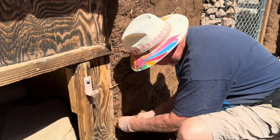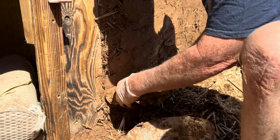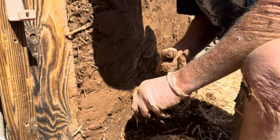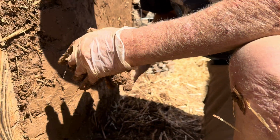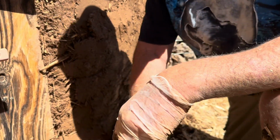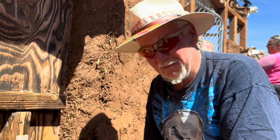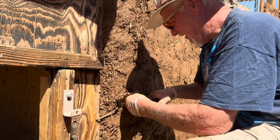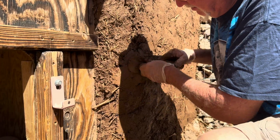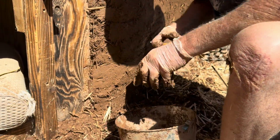Here is Clay. I wanted to show a close-up. We'll be doing some of this plaster, more like detailed plastering, on the barn eventually. Not yet. But he's using a trowel. He's doing it with a tool. So he's loading it out of the bucket and then putting it and smushing it in and then dragging it in one direction once he gets it on the wall. And it makes this nice finish. Clay's got it. And it pushes into the wall. You can see how he shimmies it in. So it's actually pushing all that straw in even more and getting it all bonded together back there.